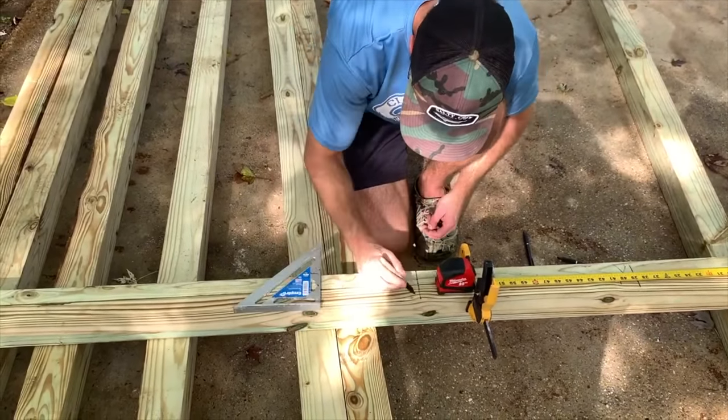So after completing this small segment, I needed to install a longer segment that would go across the window and around a receptacle box. For segments like this, you might find yourself in a position where you need to cut out segments of the ProSlat panel. And to do this, I used a clamp to hold the panel in place, and then I used a jigsaw to cut through the aluminum cavity and through that one segment of the PVC panel.